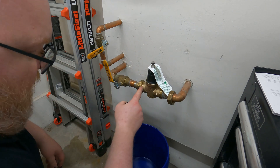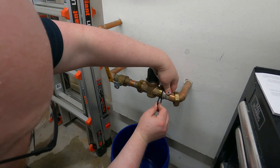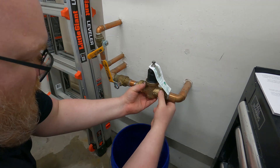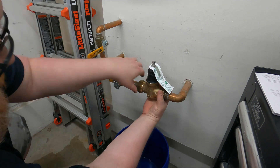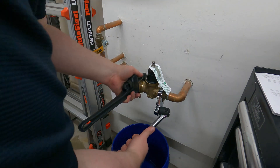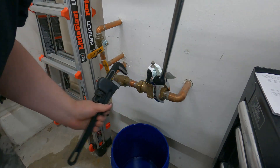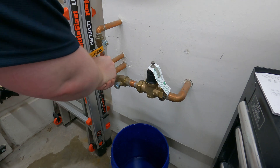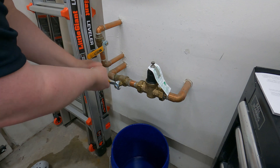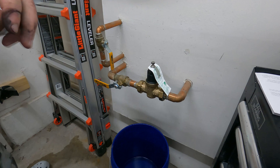We are in business. There are a few more threads on this one than the old one — you can see it's tapped a little further down — but same fit. For how hard you want to tighten it: just get it to finger tight, and then give it about a quarter turn. That should be it. Now we're going to slowly crack the water back on. We are pressurized, there are no leaks, so let's open that the rest of the way up. It looks like we didn't lose any pressure there.